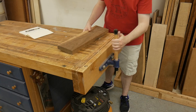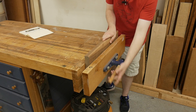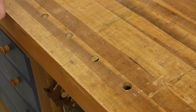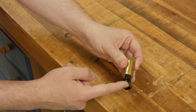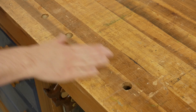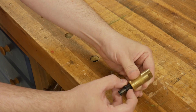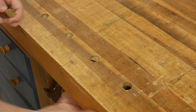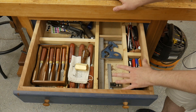The workbench has just one vise — an end vise that spans the full width of the bench. It has 12 dog holes, but unfortunately they're not through dog holes, so I'm using Lee Valley prairie dogs. They're spring-loaded — push it and it comes up, push it again and it drops back down flush with the surface. They're adjustable with a threaded plastic piece so you can make them taller or shorter depending on how deep your dog holes are.